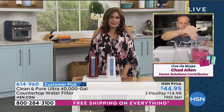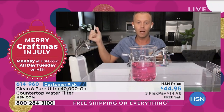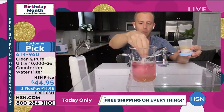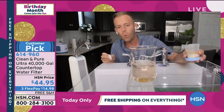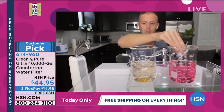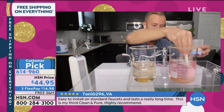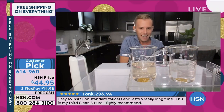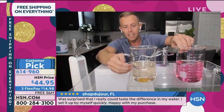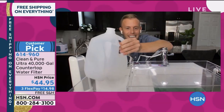In this beaker it's pink — I took a pool testing kit, just like you'd use at home, a few drops of this and a few drops of that, and you can see if there's chlorine in your water. This came right from my tap without the diverter switch. I'm going to take a little bit of that gold layer, that KDF-55, sprinkle it in, give it a couple swirls — and look what happens. The pink goes away, which means the chlorine goes away, absorbed by the KDF-55. The water turns completely clear in just a matter of seconds. There's the before. Here's the after — going from chlorine to no chlorine — and that's going to last for the next 40,000 gallons.